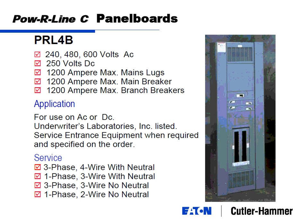And looking into your power line 4 panel boards, these are again our power distribution panels. This one is probably 90 inches high. The smallest you can get this panel in is 53 inches high. Very tough to even see them that small. Usually they're either 73 or 90 inches tall. So these are big panels. Circuit breakers, or will show fusible.